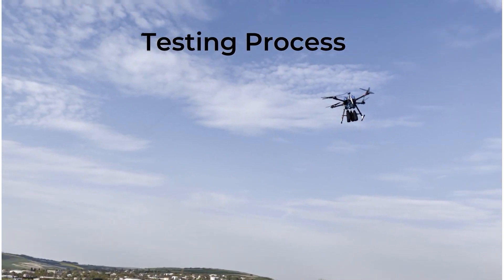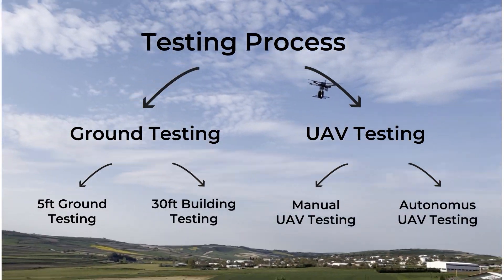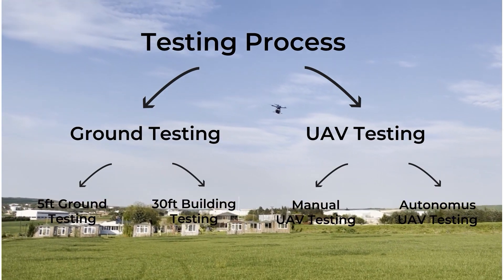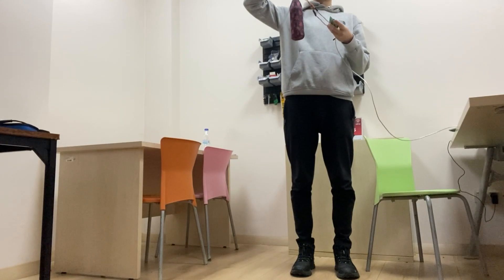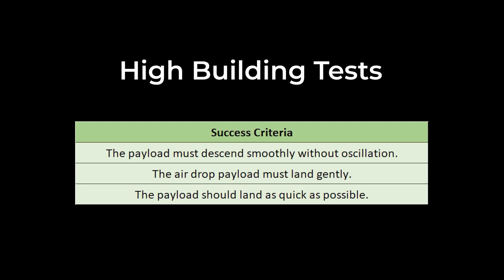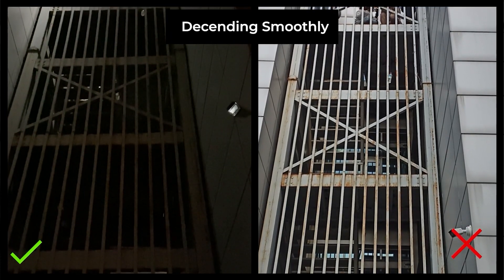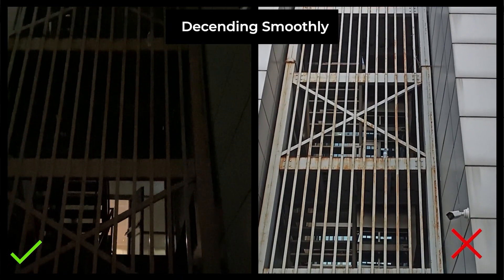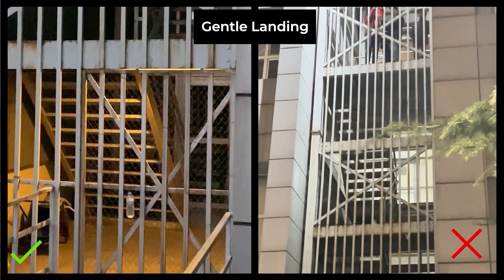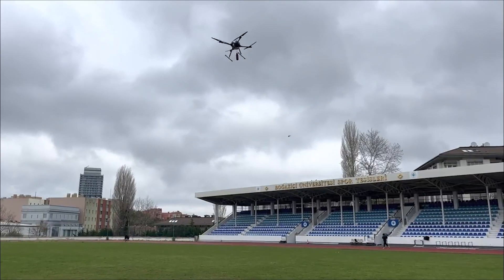Testing of the payload mechanism took place in four steps: 5-foot ground testing, 30-foot testing from a building, and manual and autonomous testing with the UAV at 90 feet above the ground. Initially, the mechanism was tested alone to prevent any damage to the UAV. First tests were conducted from 5 feet to verify the braking system. The mechanism was then tested from a building at around 30 feet. After each test, necessary design, software, and hardware improvements were made. After achieving an 80% success rate, the mechanism was assembled to the UAV and tested, first manually then autonomously, from 90 feet AGL.